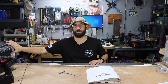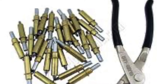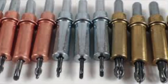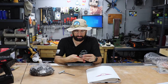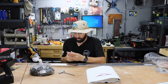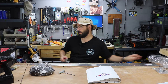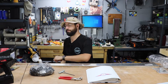Let's go through some of the stuff in the toolbox. One of the main tools that you're going to need to do all this work is what's called cleco pliers. And what those do is work with these things called clecos. A cleco is basically a temporary rivet, as I like to call it. As you're piecing parts together, there are different size clecos — you slide it in, squeeze it, and if it's the right size for the hole, it'll hold that part together with another piece of metal. We have to go through the book and find the correct ones for the correct parts, but that's one of the main tools you'll be using in the beginning.